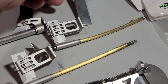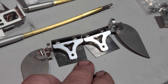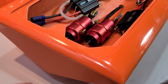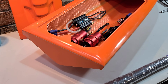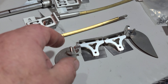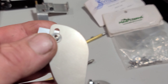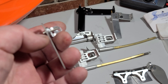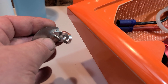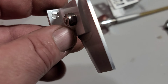We're probably going to use this rudder blade right here. This isn't a center-mounted bracket so we're probably going to make a bracket for it. I'm going to use the V1 Sonic Wake rudder blade — it's what I have. But I really wanted the rudder to be extended past the props. I don't think this is going to cut it — it needs to be extended past the propellers, not in front, so we get a good turn.